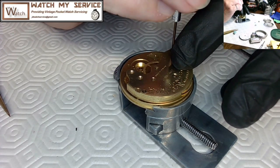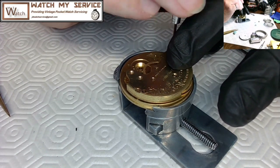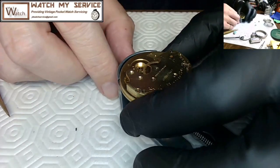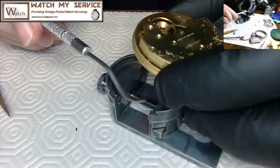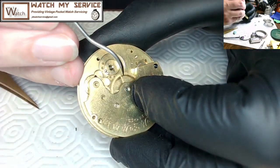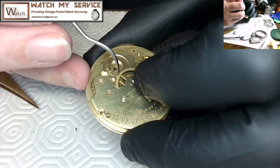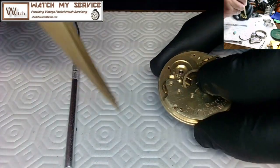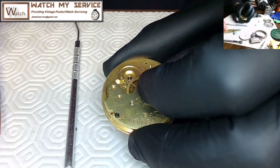A good trick to line up the plate is to find the groove for the crown wheel on the winding mechanism first — everything else lines up from there. I use a curved tool from a hobby shop, which is better than a straight tool for tweaking pivots into place. My technique: put one screw in loosely first so the plate stays in position, then I can pick up the movement and tweak the wheels on top to get them all seated.